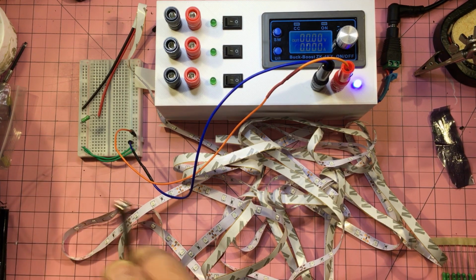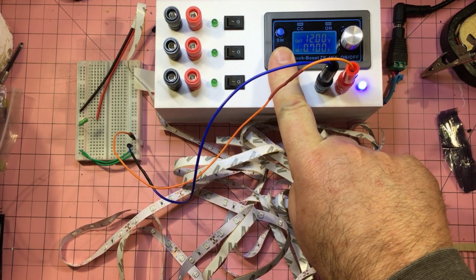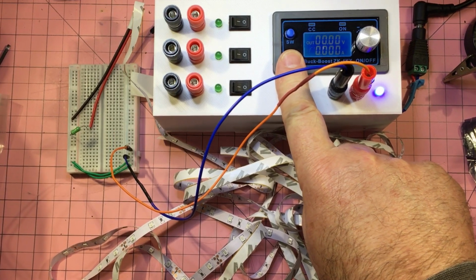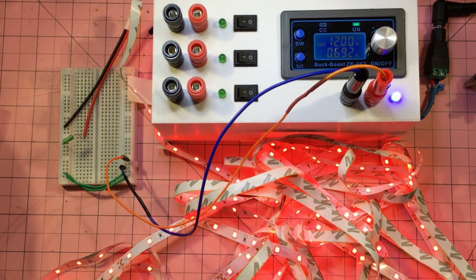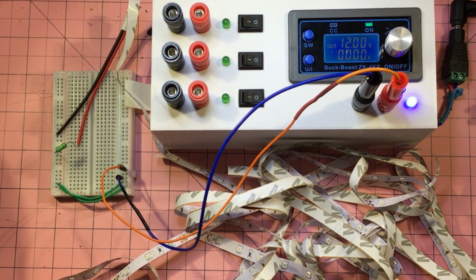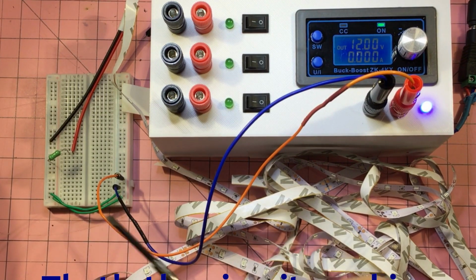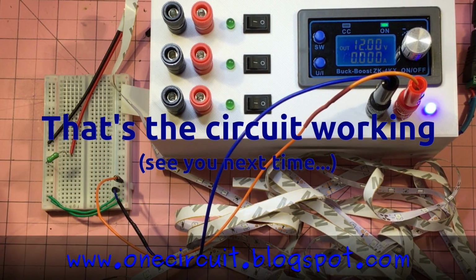All right, so there's the 250 guy in there, and here we've got 12 volts and 0.7 amps as the current control. Shouldn't be required because that guy should blow before that. That is the theory. And there's a bit of a surge when it first starts, so I'm hoping it goes straight away. Here we go. And yeah, that's not too bad. So within a second or two, that's blown. So the 250 guy, around about 400, 450, about double what you'd expect. So yeah, interesting, these fuses. Not sure really about how accurate they are, but I still think they might be useful, knowing the limitations anyway.